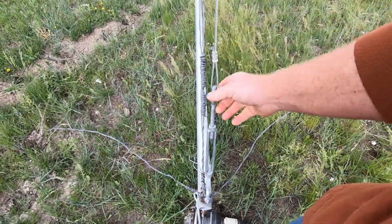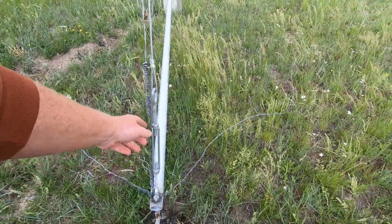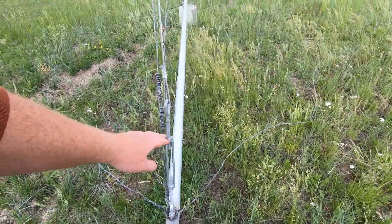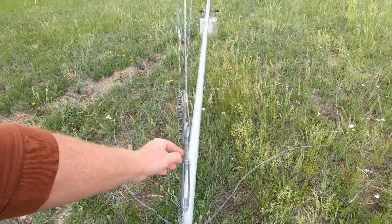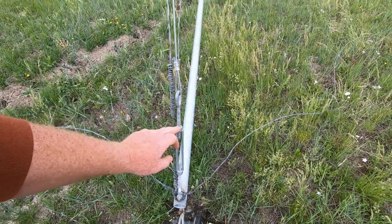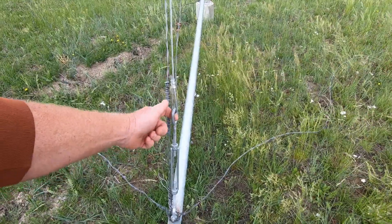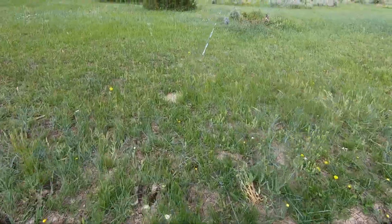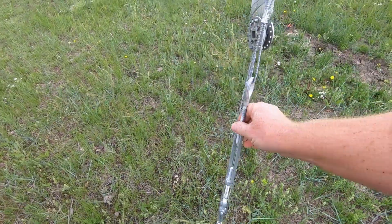So yeah, the tower almost went down just because of that one thing. Easy enough to fix, but I guess the ultimate solution is to take this tower down sometime in the future and put some lock nuts on the ends here and really cinch them down, or put some safety wire here and wrap it around something. Who would have thought this looked like a foolproof setup?